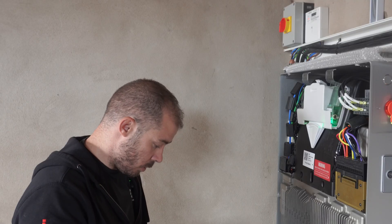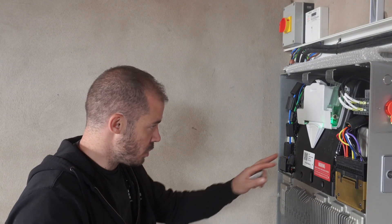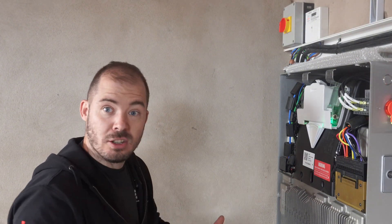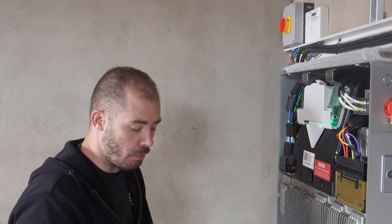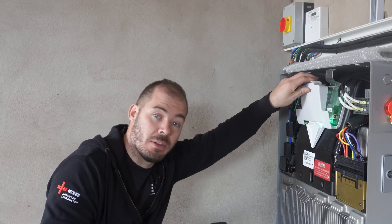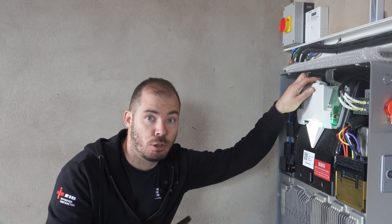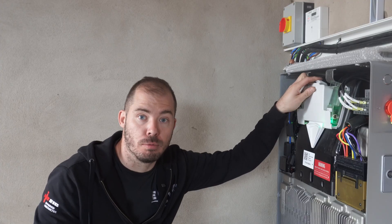Commissioning a Tesla Powerwall. The Powerwall to commission usually is really straightforward. All we've got to do is get an installation and scan the QR code, connect it to Wi-Fi and then do a few little tests. We won't take it off grid just yet because the parallel earth rod isn't in. We can only test up to now the one string. Everything else has been set. On this site we have 11kW on-site capacity and 9kW export limitation.